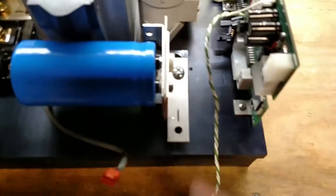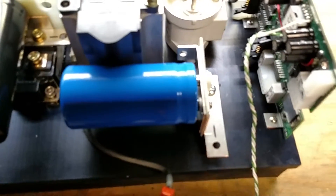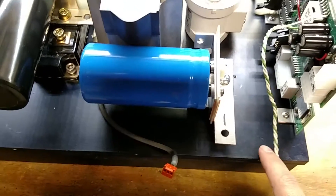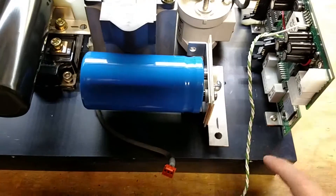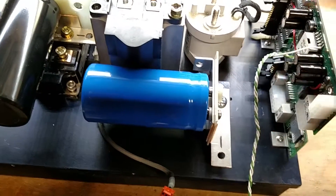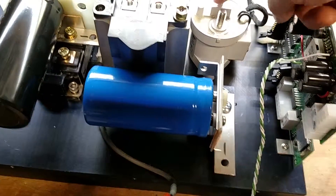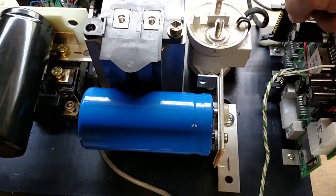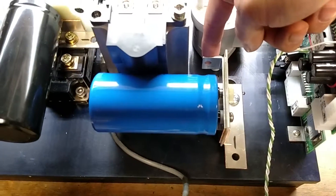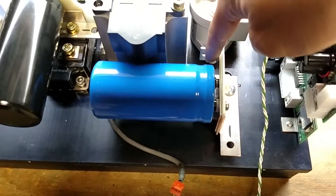It's about half an inch thick, which is fine for the 48 volts it's going to be dealing with — or 60 volts depending on what I do. It can go up to 100, but I'll probably keep it around 75 volts or below. So the high current 48, 60, 70 — whatever voltage we end up with — will come in, go to this terminal on the contactor, and then off of this will be the main 48-volt filter with the bus for the filter cap, and it'll come off of there.